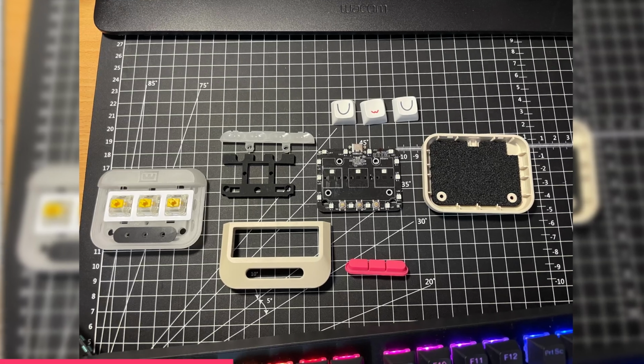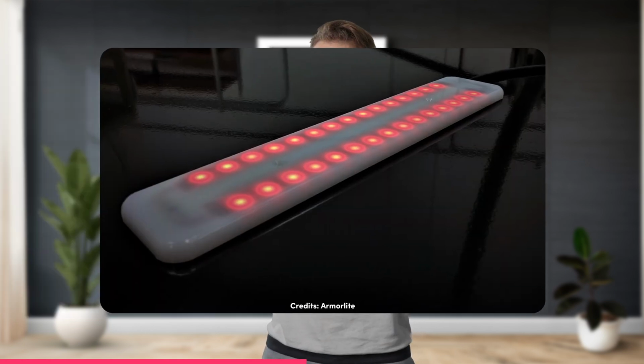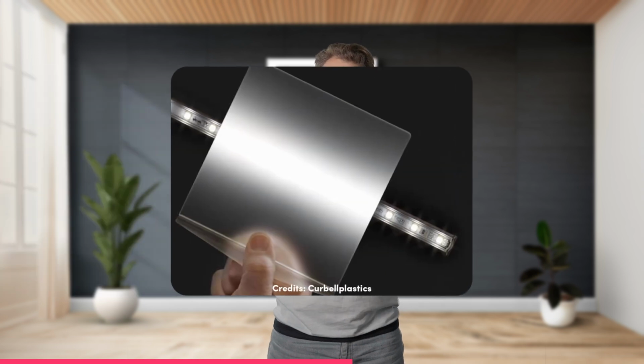It starts with the design of the light bar and of the plate, how it guides the light to the sides and how it guides light to the top and spreads it out, but also all about the translucency of the plastic that is used for the light bar. Too much translucency, you get a spotlight effect. Spotlight effect is where you can very clearly see a spotlight of light, and then it gets weaker and weaker outwards. Now that's not nice on the device, it looks very ugly, so you want to add some diffusion, which spreads the light more evenly around.